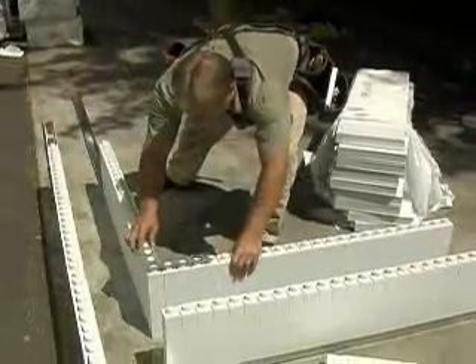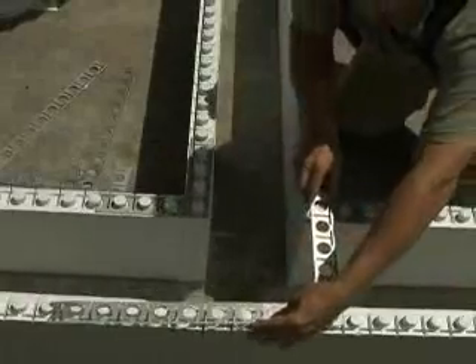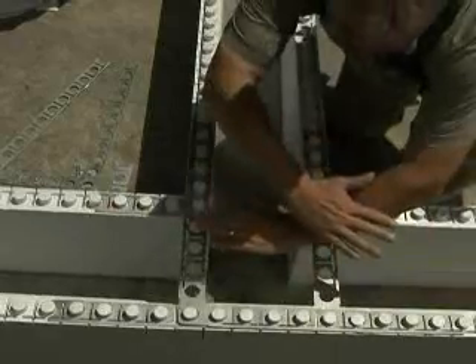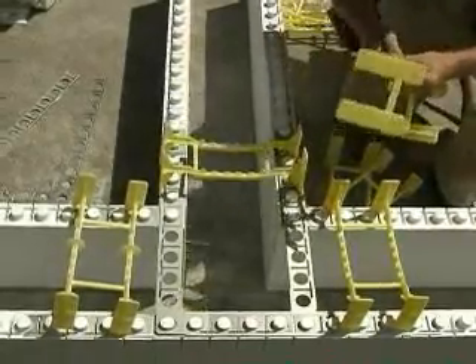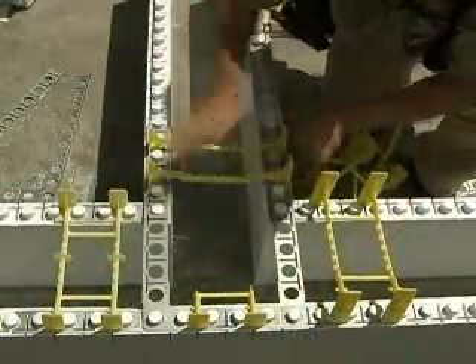Place the smaller inside corner bracket over the two 90-degree corners. To secure the outside walls, place two large outside corner brackets so the brackets overlap in opposite directions along the outside row of panels. When secured with ties, these brackets will connect the outside of the T-wall to the leg of the T-wall and eliminate the need for external bracing. Place a full tie on either side of the T-leg as close to the T-leg as possible. Cut tie flanges and place between full ties at the center of the T. Place a full tie in the corner bracket at the top of the T-leg.